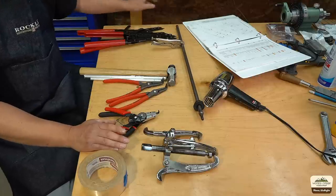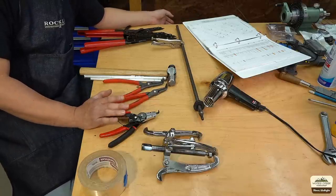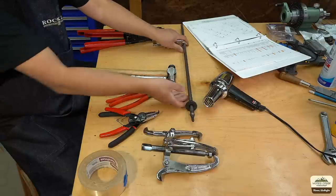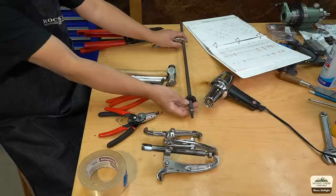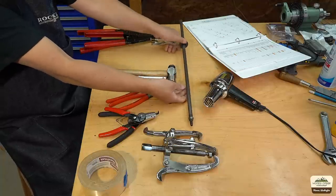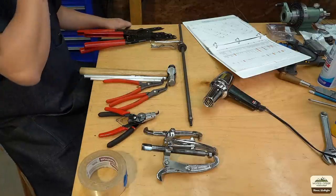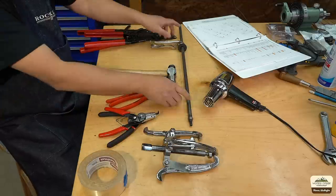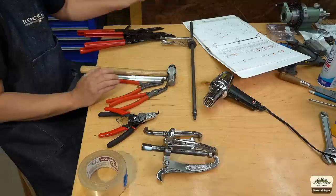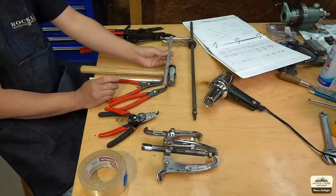This thing right here is my version of a slide hammer. I didn't have a slide hammer and nobody in town had them. I did order one through Amazon but it was going to take three or four days. So being impatient, I just welded a correct-size bolt to this cold-roll steel with a vice grip and a big nut. The shafts in the headstock all have threaded holes, and that's generally the direction the shaft will come out. So I would thread that in and hit it with a hammer, and I was able to remove all the shafts I needed. If you have a shaft with an opening on the opposite end, you can use something like this and a hammer to drive it out from inside.